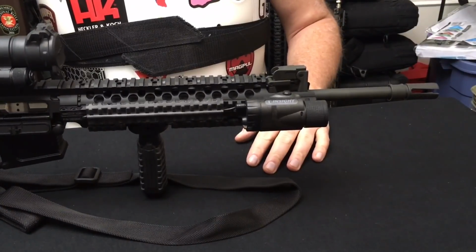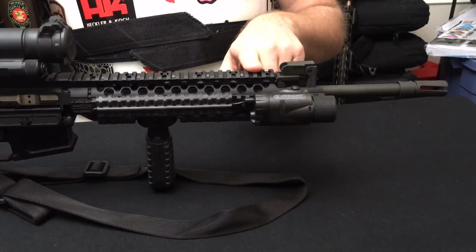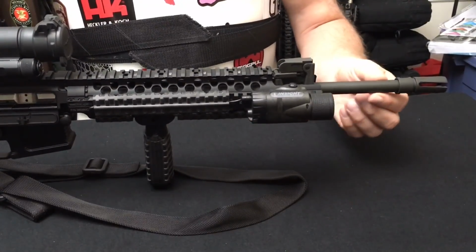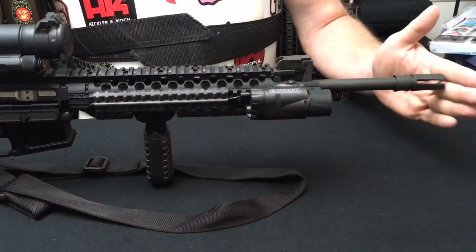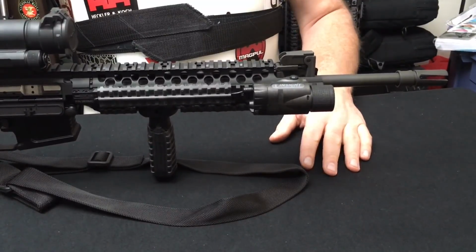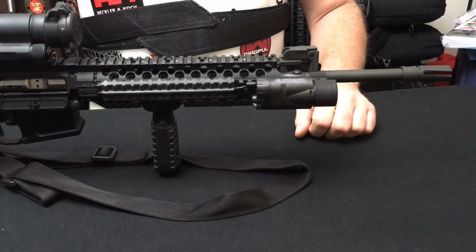I've had too many bad experiences with rapid fire or fully automatic, with the front sight base actually migrating forward. All of a sudden it starts cutting down on your gas, you're getting short stroking, and then to the point where it will cut off the gas altogether. So I do prefer the drill and pin method. The barrel itself is a hammer forged FN barrel with a Vortex flash suppressor. The Vortex flash suppressor, according to all the testing that I've personally done and I've seen, is the most efficient flash suppressor in the industry. It's made by Smith Enterprises, and Ron Smith there makes them from 5.56, 30 caliber, up to 50 caliber BMG. It's an excellent design.